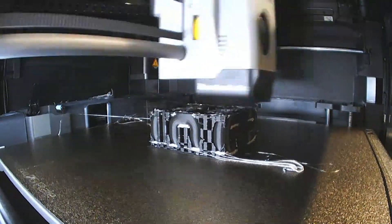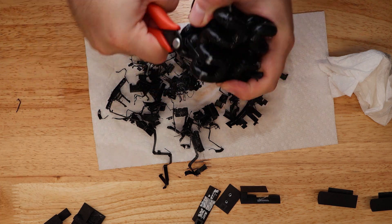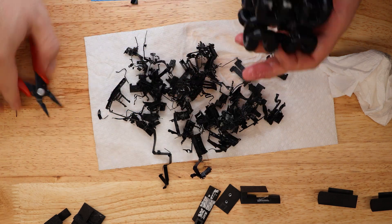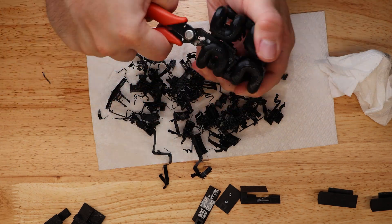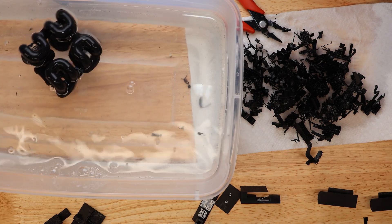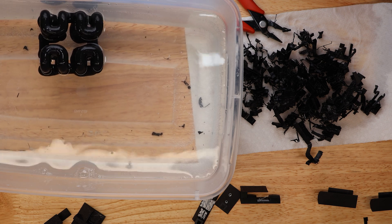The real test here was that Hilbert Cube. Due to how intricate this model is, there's no way you're printing supports in PLA and removing them without damaging the model. I'd even be surprised if you could get them all, because the support area inside is greater than any gap you have to remove it around the model, much less use the force to actually remove it. I decided to try saving myself some money by printing PVA between the support structure and the model, which is commonly called the interface. Toss it in some water, let it sit for a while, and hopefully the PLA supports inside will be super easy to remove. So I'm printing PLA when I'm lazy, throwing away the PLA support material, and using PVA all the time.